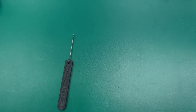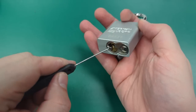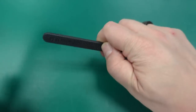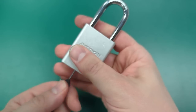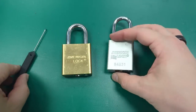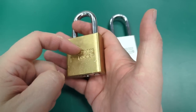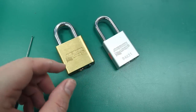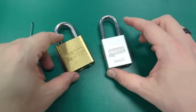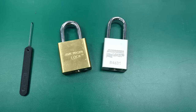That's no bueno. So if you run into a lock in the field and you're like, is this lock actually going to work? This is one I just pulled out of our bin of parts. I don't know where we got it, but I said, is it going to be good for this demo? I couldn't quite get her in there — I'll give it a little bias and a little encouragement. This might be an example of a lock that has the protection element that American Locks started putting in their products to shield the rear side of the plug. All these locks were unshielded for the longest time, and then once Peterson Tools and others started selling these bypass drivers, they said, well, we got to do something. So they started shielding the backside.